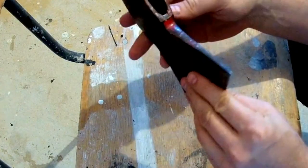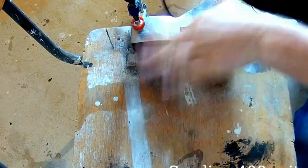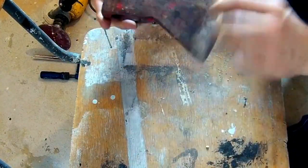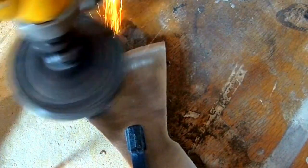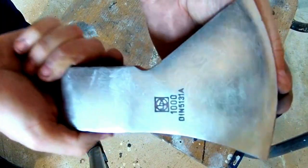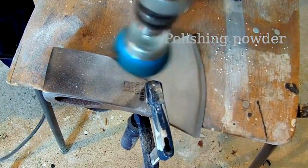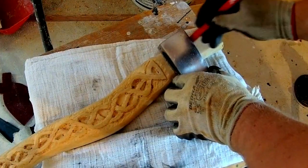Now it's time for the blade. I had one that was very rusty and not very sharp, but it was made from fine steel, so I decided to restore it instead of buying a new one. First I used sandpaper and removed all of the rust and then the bumps, being very careful not to overheat the blade, because overheated blades can lose their temper. I used sandpapers from 100 grit up to 3000 grit, because I wanted to make a mirror finish on my blade — and I achieved that, as you will see at the end of the video.